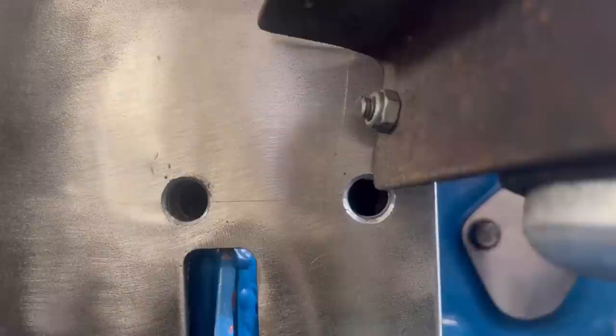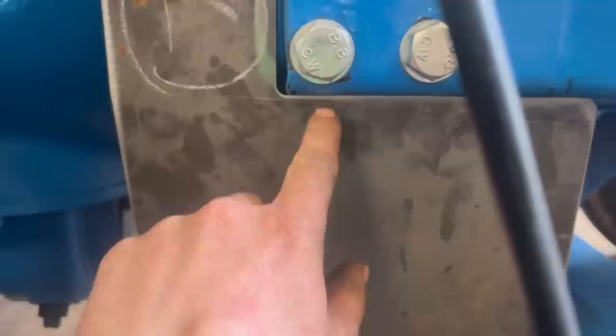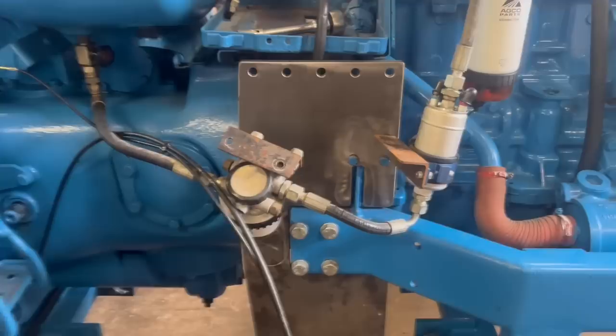Right, that's better. Our new bolt holes match up properly now. But again, the bolts are too short. So we're going to have to get some longer bolts. But what I can do now is put a press on here. I think we'll press it like 50 mil down and get that pointing in over like that. Right, so I need it pressing across there now, at that angle.